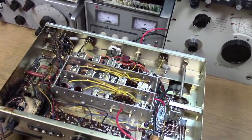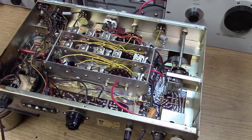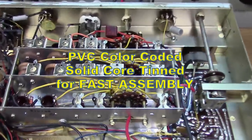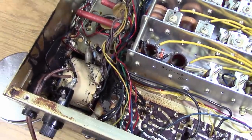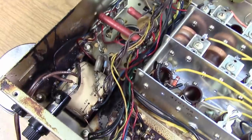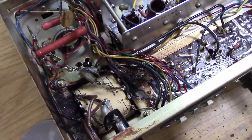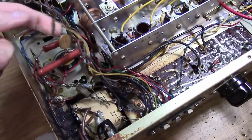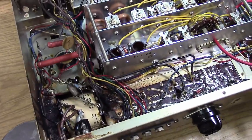Pretty much the last thing you want to do with these radios when you acquire one is simply plug it in and turn it on. You do not want to do that, especially with some of these Japanese-built radios from the early 60s. The wiring is all hand-wiring from the 60s. Over here in the power supply section there's been an event of some kind — you can see some charring and a little bit of cooking. We don't know if this is a replacement transformer or if it's even working. Looks like somebody's doubled up the diodes — it's a pretty big mess with horrible twisted and brittle wires. You did not want to plug this in not knowing what's going on.